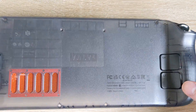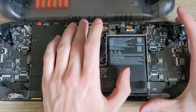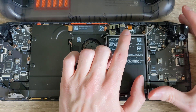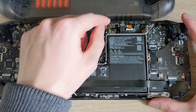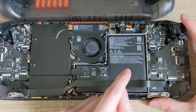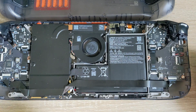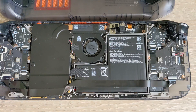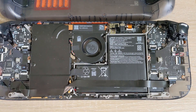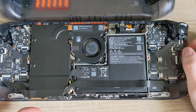I got the thing apart — it was kind of annoying to take apart because I wanted to do it without damaging or scratching it, so it took a lot of time. I'm going to set up a test where I plug the headphone jack into the line in on my computer, set the volume levels as flat as I can, get a recording sample, and see what it sounds like with the board screwed in versus removed.